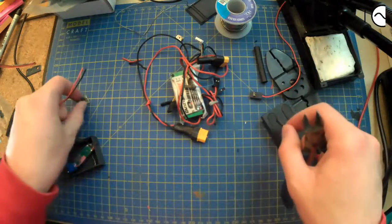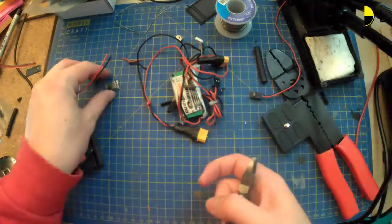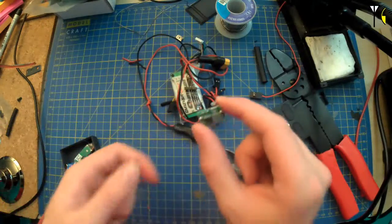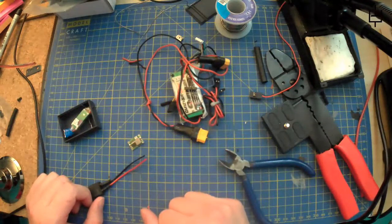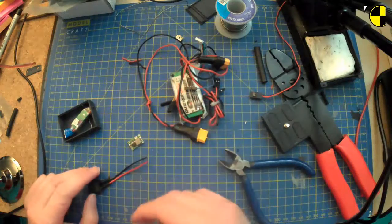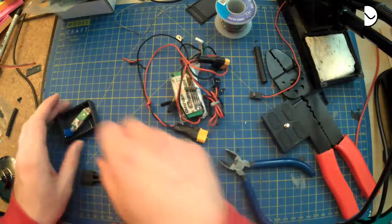Oh, what, these things? Is that what you're talking about, Pencil? These Mini 360s. Yeah, it's fine. It's just the temperature instability of the voltage output. But like I said, if I put these on a low 2S to begin with, then 20% higher isn't going to fry anything, at least.